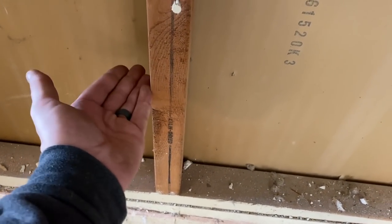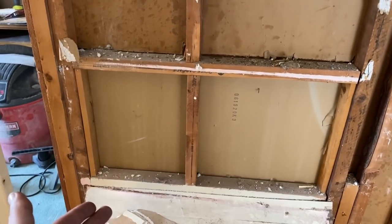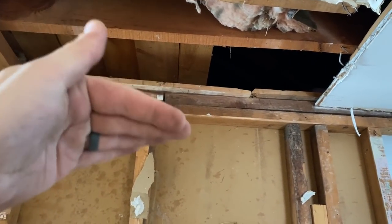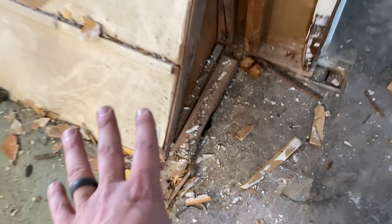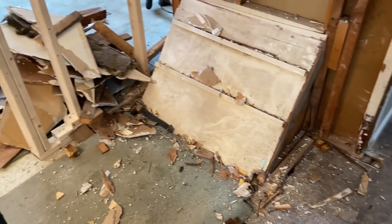I will be able to reuse this framing. I'm going to end up cutting these joists to get more head height in the basement, then frame that under there. As long as I get the ceiling height correct, I should be all set. I have made a mess, so I'm going to clean this up, take all this stuff out, and probably throw some insulation up there to make it as safe as I can, because I do have a one-year-old that roams around and gets into everything.